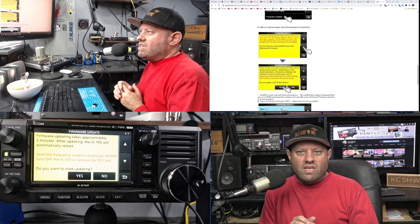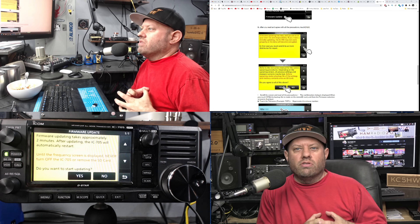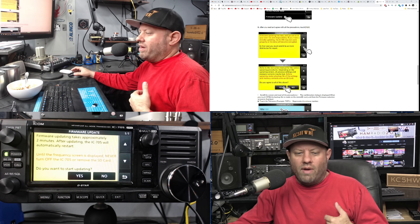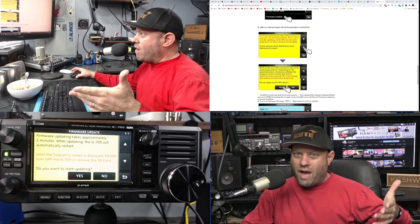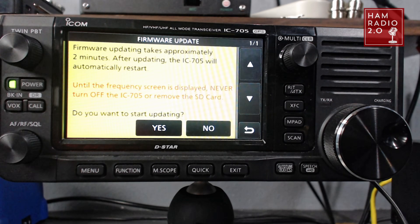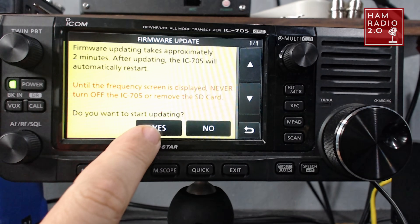Some of these HTs don't have an option for that, and quite frankly, if you have a full charge on your 705 battery it's probably fine, but just to be safe I'm plugged into my MFJ power supply right now. I suggest connecting to an external power supply so that you don't accidentally lose power during the firmware update, because it will mess things up. The important step here is to hold this button down for one second.